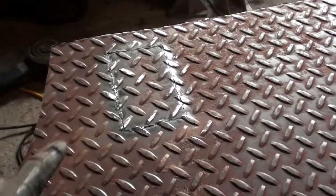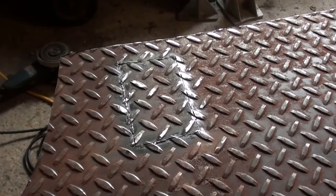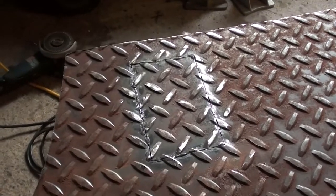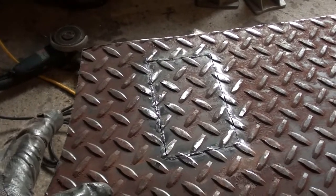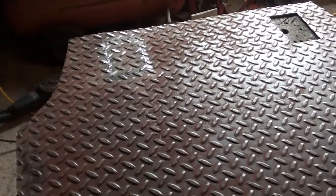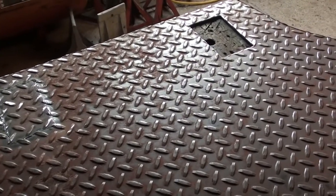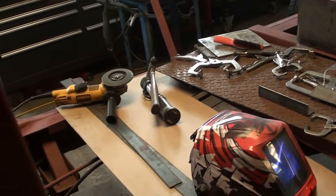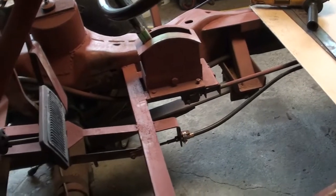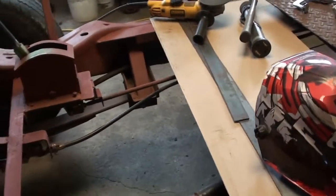I will note that it did start to warp this plate, which is at least an eighth inch — fairly thick material. Just that little bit of welding, and I was stopping, doing about an inch and stopping for a minute, then another inch. But it put enough heat into the material that this thick plate started to actually buckle and warp a little bit upwards. You have to be really careful welding this kind of sheet metal because you put too much heat into it and it will distort. So I decided I'm just going to slow down and start working from the front and make my way back, with the first step being to get that large front plate into position.